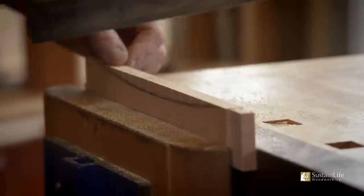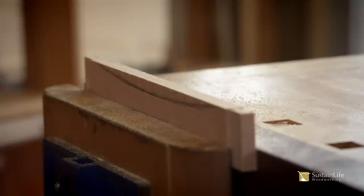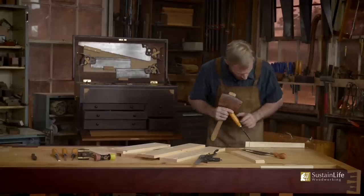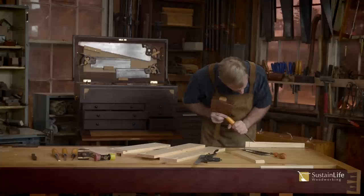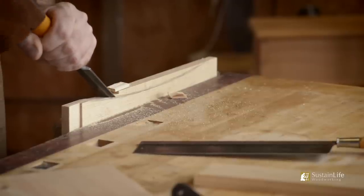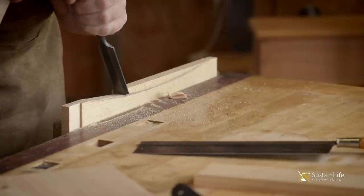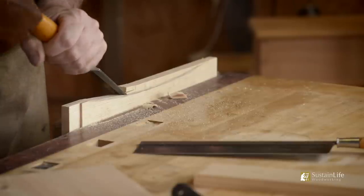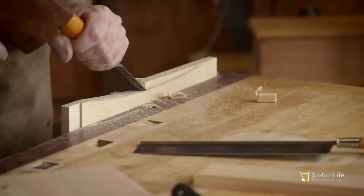As you can see, they're varied in height right along the entire length of the board. The next step is to come back with a chisel and remove the waste. I've turned the piece around so that you can see my chisel following the line. I'm going to take the chisel with the bevel down and follow along that line, keeping the chisel engaged in the cut. As I work this along, I can raise the chisel for a deeper cut, or bring it down for a more shallow cut — I can actually adjust the depth of cut as I'm working it along.